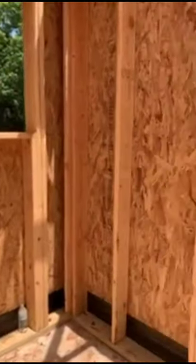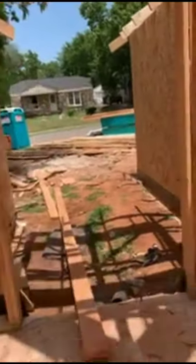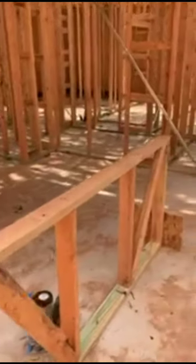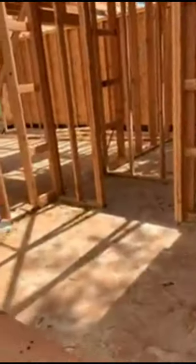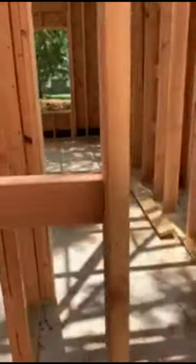Wood doesn't insulate well. Here's the front room, and if you hear somebody talk about California Corners, this is what they're talking about — so we can insulate back behind there and not get a cold corner. This will be double doors to the office and a back patio sliding door. This is the entryway — we'll have a nice door with a side light. This would be the kitchen island. There'll be a range back there, a couple of cabinets, cabinets along this wall and this wall, the refrigerator on this side, and then we have a walk-in pantry — it's going to be a good-sized walk-in pantry.